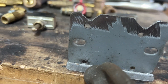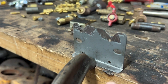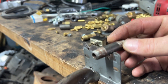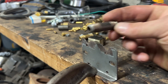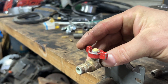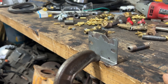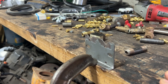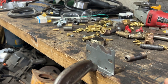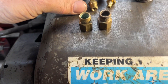I made up this little bracket — just something I had laying around. I cut a couple of V's in the top and put a little bend on the bottom. Now I'm going to take some quarter-inch NPT black pipe and just weld two of them together, and that's going to hold the two little ball valves that will switch the argon from either the spool gun or the argon/carbon-dioxide mix for the regular steel MIG welder.